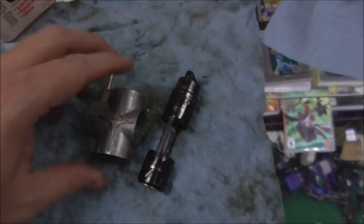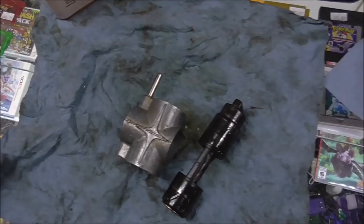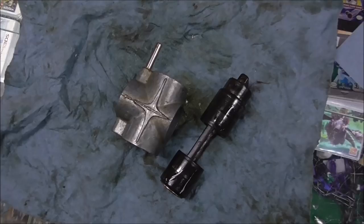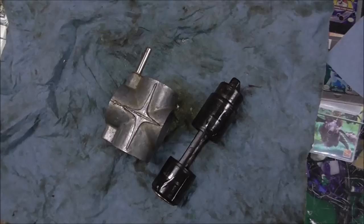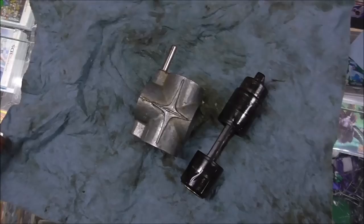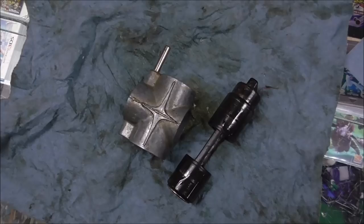All right, so we're just going to oil it a little bit and start putting the stuff back and clean each piece really good as we go. Not necessarily clean it cosmetically, you're just trying to get all of the grease out of it that's all gummed up. And you'll see exactly what I mean as soon as you start messing with it. You'll go, oh, okay, yeah, I see exactly what he's talking about. It's like the stuff is so thick, it's almost like glue. It's like cake batter or something. That just makes it all sluggish. But I'll show you at the end of the video here, when it picks that record up, you'll say, well, hard to deny that that's what the issue was.